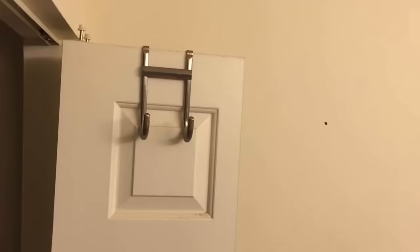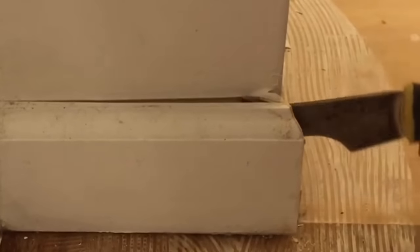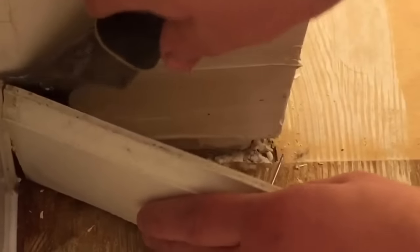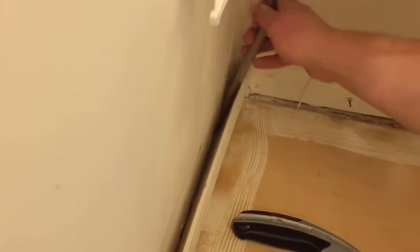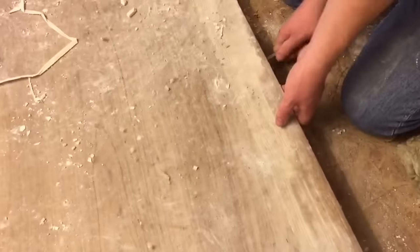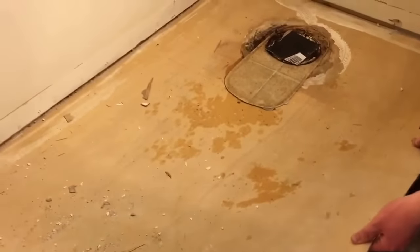It's time to start taking off doors — I take the closet door off, and if the main bathroom door is in the way, you might want to take that off too. Then I start peeling off the linoleum and cut the molding, since there's caulking around the top of the baseboard. Once that's cut I can pry off my baseboard — I'm probably going to reuse it so I take it off gently. After removing all the molding around the room, I take up the 1/8-inch luan that's stapled in, which gets me down to the subfloor so I can start fresh with a new subfloor.